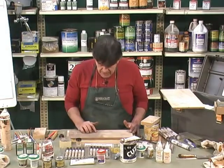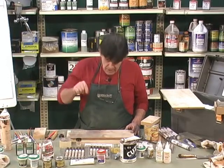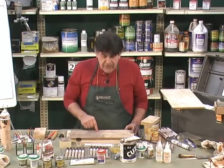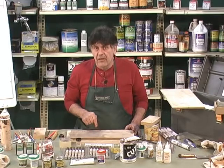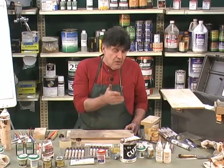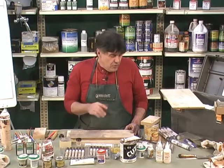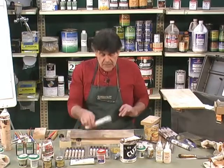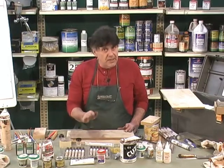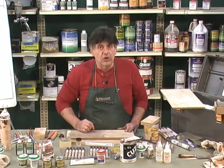One of the things I see people do constantly is, I call them daubers, like the old mud dauber. They'll take some filler and they'll just barely wipe it on. No. You want to get that filler in contact with your wood. Liquids like the cyanoacrylates or the epoxies, not the case. They're thin enough they're going to run into there. But when you get into the epoxy sticks and you get into the fillers, particularly the epoxy stick, it's pretty stiff. You want to wipe a little bit in there really, really hard